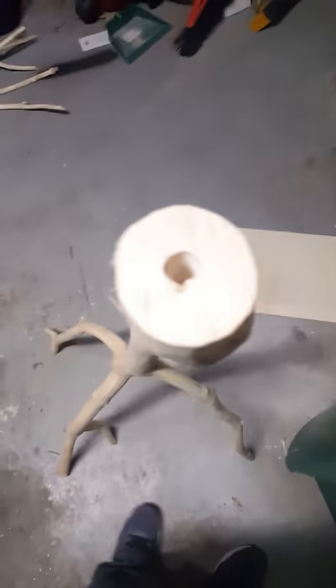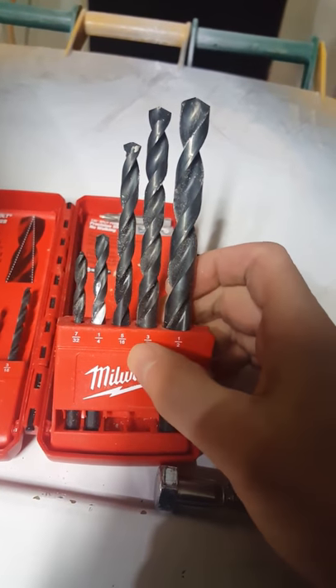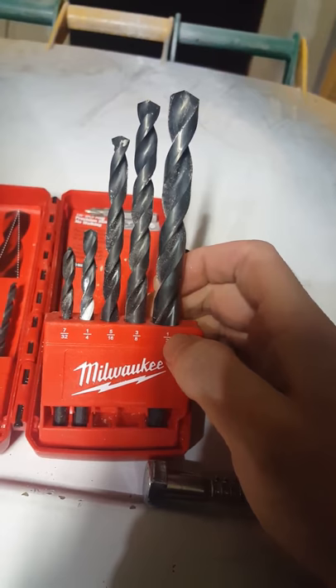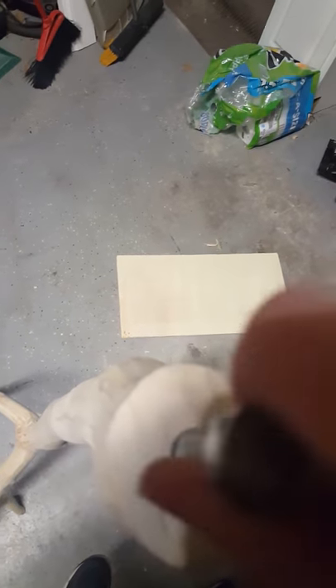What I did now is I drilled a hole in the bottom of the stand. I used the big one here to start it and then I went down to the 3/8ths, just a little bit to get it going, then went down to 3/8ths so it would be enough to grab the screw. And then I just used this bolt to screw it into the top of here. Then I figured out where I wanted to put the hole in the plywood base and I drilled the hole so that the bolt can go right in.